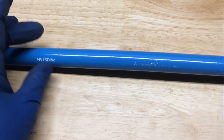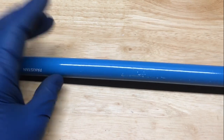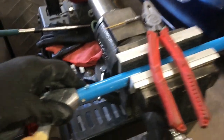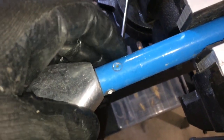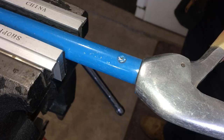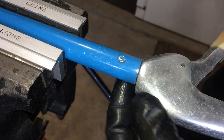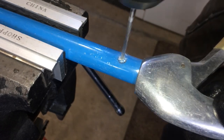Since I'm going to be removing the ends, the pole, and the cable, you could use all the steps in this project to lengthen or shorten your snake grabber. What I'm doing here is drilling out these rivets. There are three rivets on each end — I've got one started. I just used a drill bit a little bit larger than the center part, and I'm drilling it out the same way as you'd drill out any rivet.